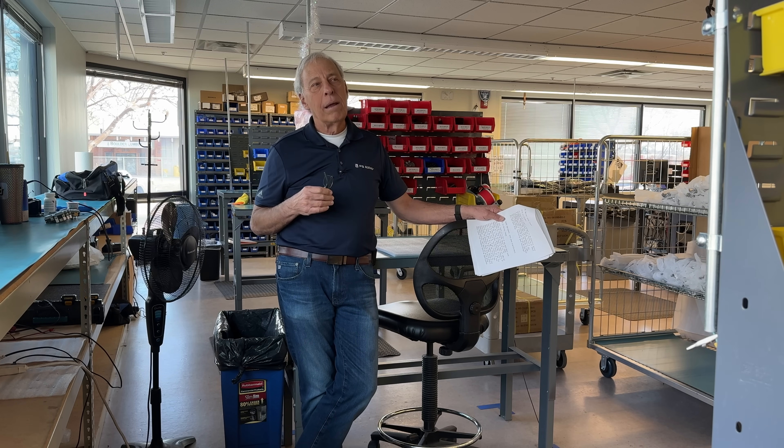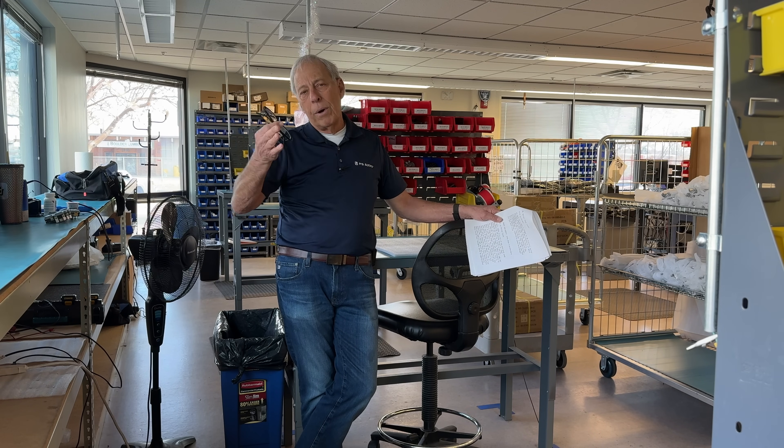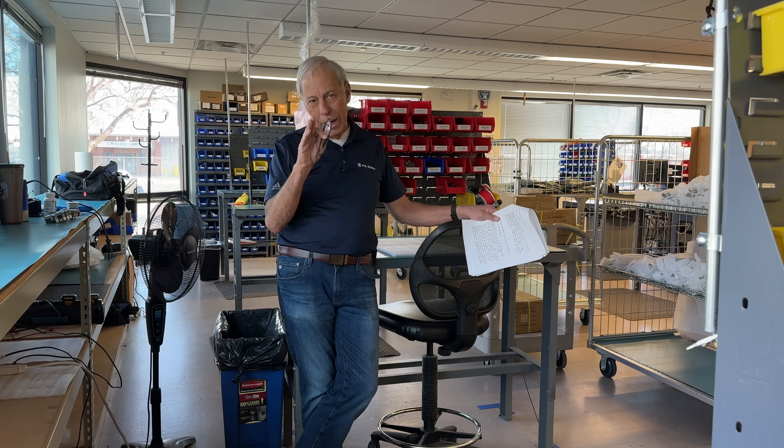Having said all that, most Japanese equipment — in my experience, and this is something you want to look at — has a range on it and is fine running at 120 volts. Not that much difference. So you want to check your home line voltage. Like at my house, we run about 117, which is 17 volts higher than the rated thing. But if you look at it, it usually has a range — like it'll do 90 to 117, and 100 is kind of in the middle.